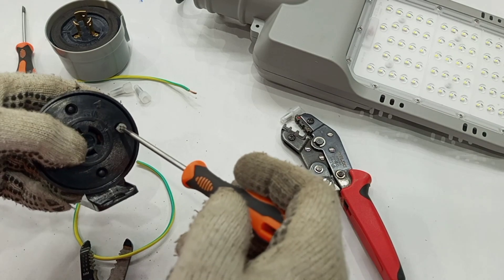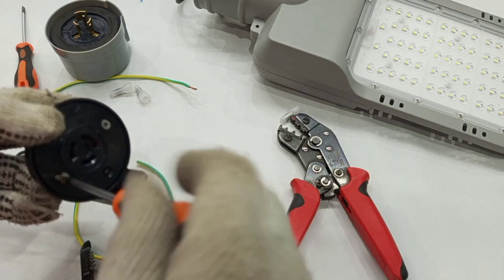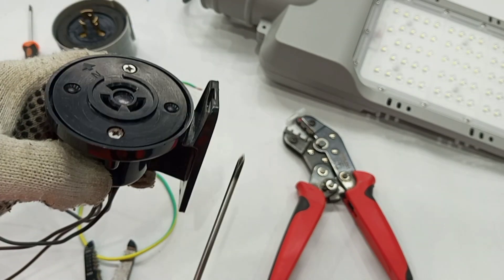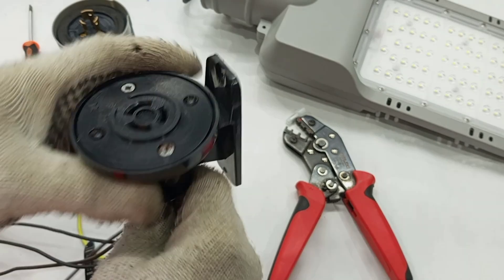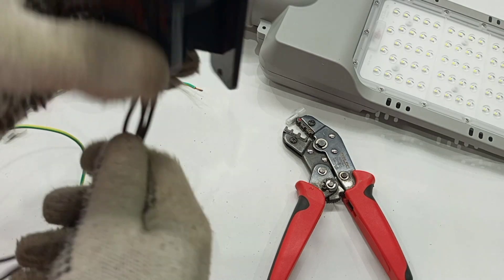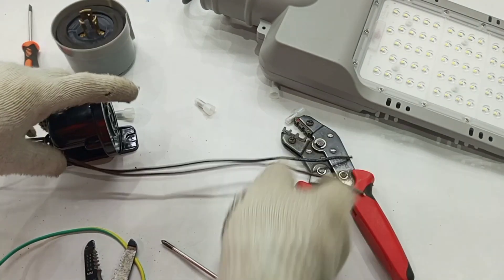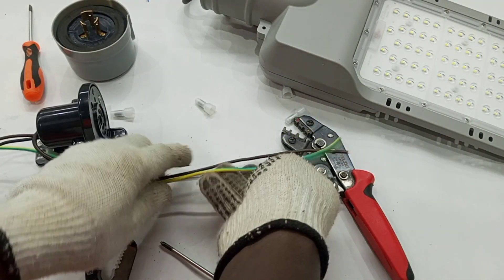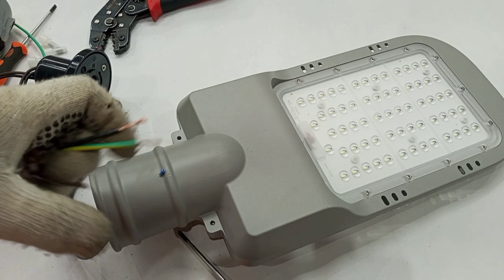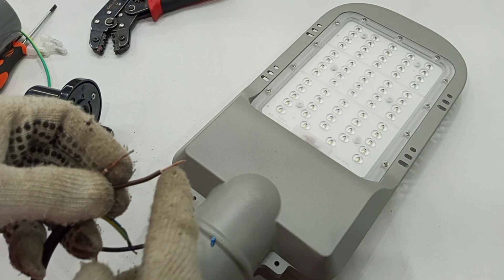We secure using the screws. Whether you are mounting this photo cell on a wooden pole or a wall, it must be positioned so that the cable entry always faces downward. These are our output wires to the street light — live and neutral.